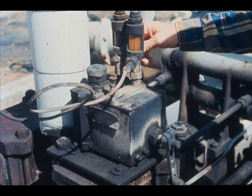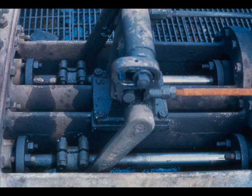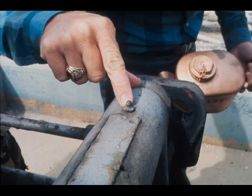Normally, an automatic lubricator supplies lubricating oil to major moving parts. Other moving parts must be lubricated manually. The pump's steam end transfers power to the liquid end mechanically through rods and rocker arms. Since they are moving parts, rods and rocker arms must be lubricated frequently. In some cases, grease or oil fittings make lubrication easier.